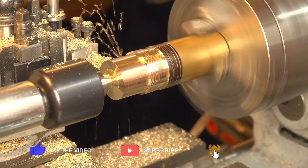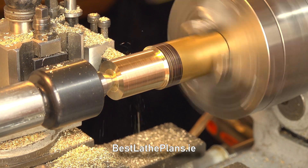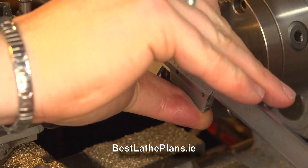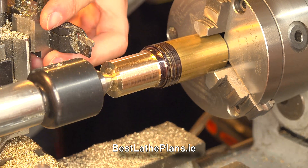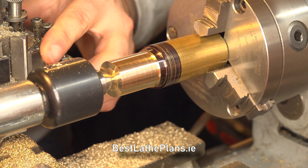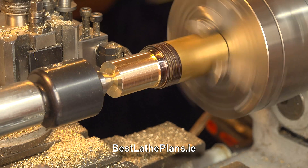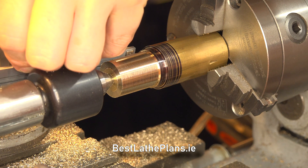Through a series of cuts I reduce the diameter to the correct size. I then switched tools from the roughing out tool to the parting off tool, and you can already see a nice expensive pile of brass chips building up on the tool and on the lathe ways. The body is starting to take shape nicely, so I mark out some of the decorative cuts on the base, then use the parting tool to form the rough shape for the base and mark where I'll be parting it off.